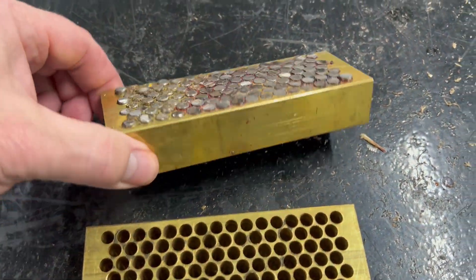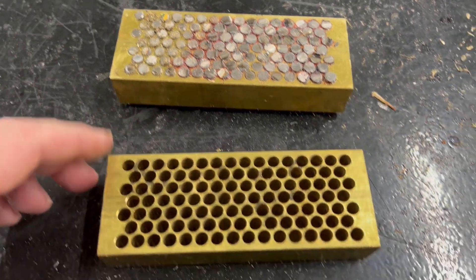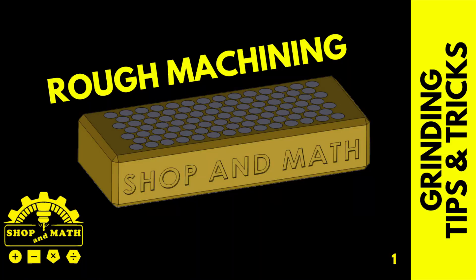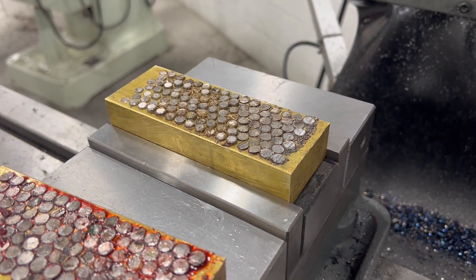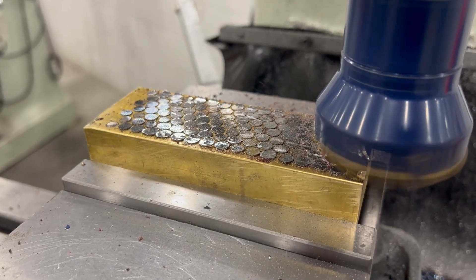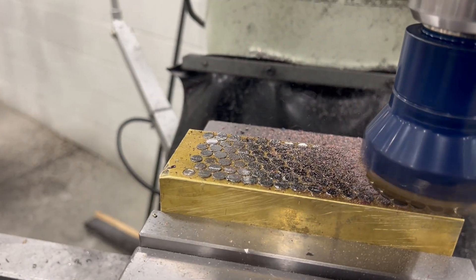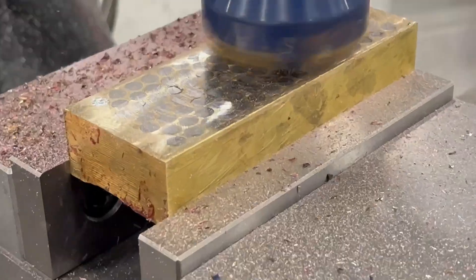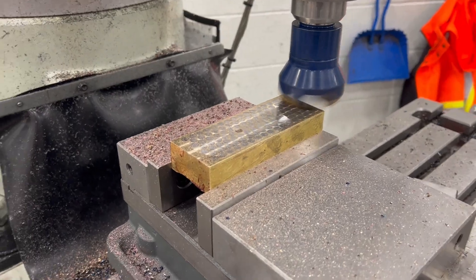This took forever to put these pins in and grind them — I'm surprised how long it took. Rough machining was probably the most difficult part because there's not a lot of room to hold onto this from underneath to set the parallels down to machine them parallel. The added bonus is that the Loctite when you're machining it actually smells pretty good.